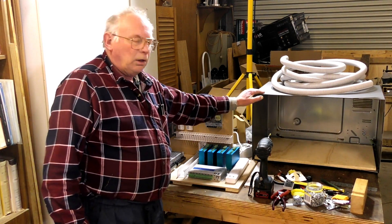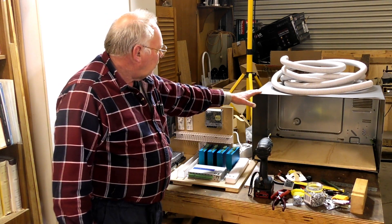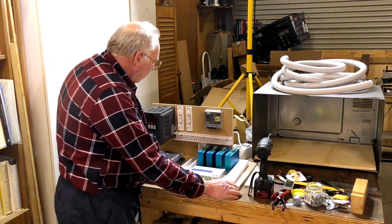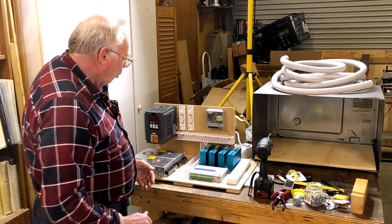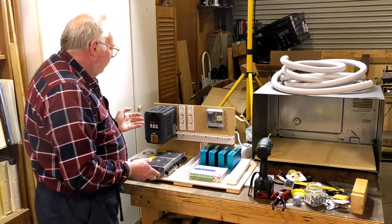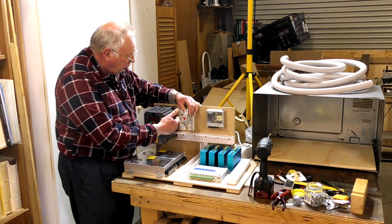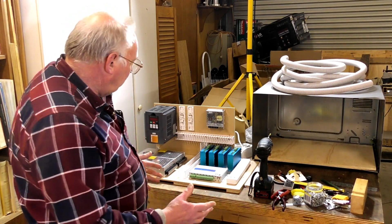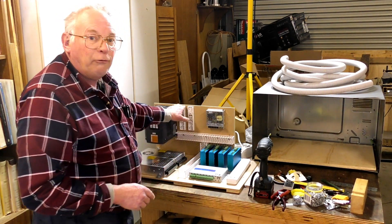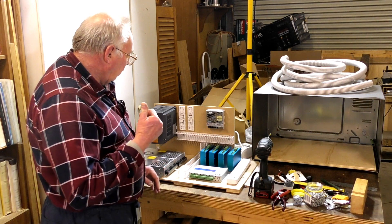The cabinet is actually an old microwave oven — a large microwave that packed up a year or so ago. But I don't chuck anything out because I always turn it to good use. So I've made up an L-shaped board and put all the main components on for the electrical build. I'm putting two 10-amp fuses in here because I like to split my circuit up — the VFD and spindle on one feed, then the power supply and everything else for the servo motors.